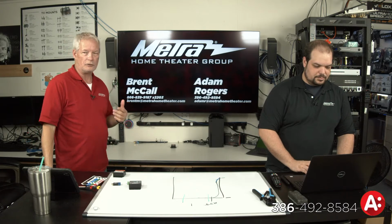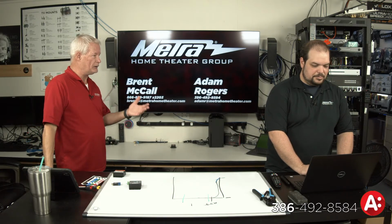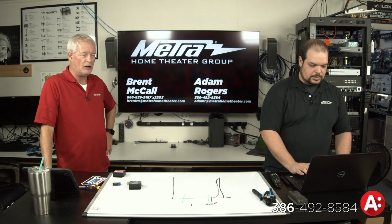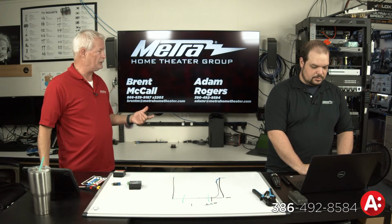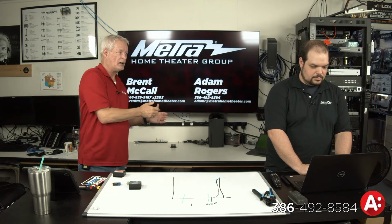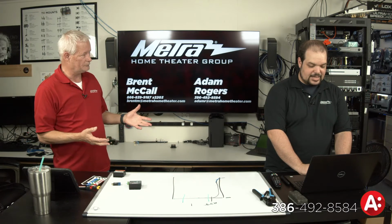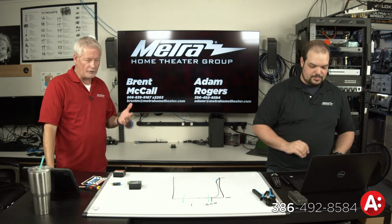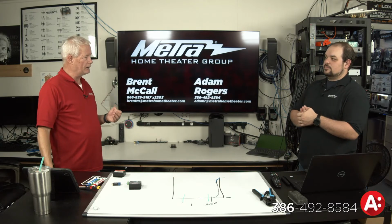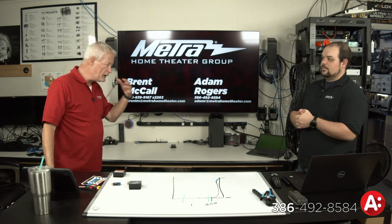Yep. We also encourage you to give the customer a help button, if you have any kind of programmable remote, that just opens and closes the relay, because if you have an Apple TV or DirecTV 4K unit, when you're going from 4K back to 1080p, it may not transition correctly. Exactly. That is another great tool to have in your kit, and the CS-IR Kit CCUS is reasonably inexpensive.